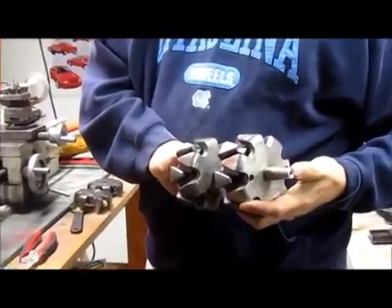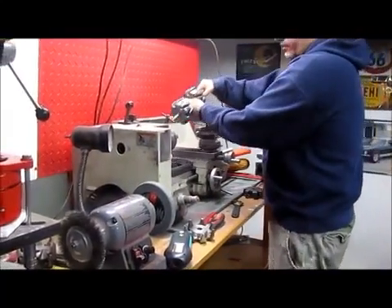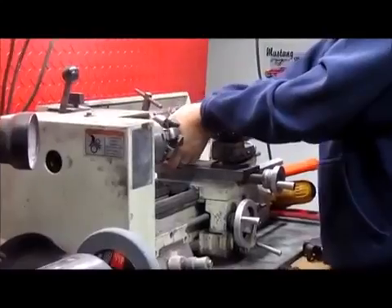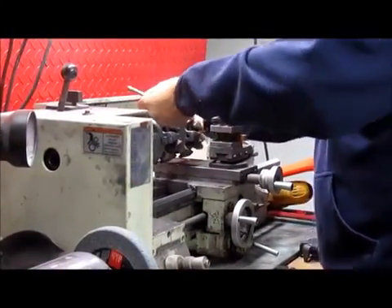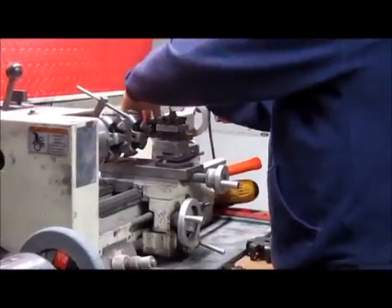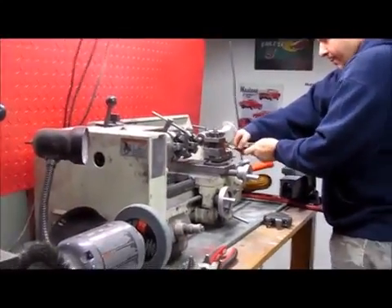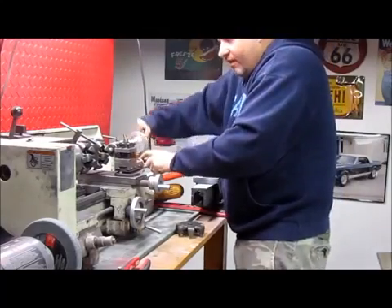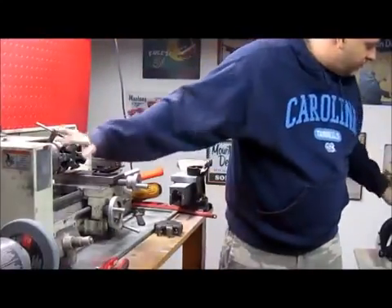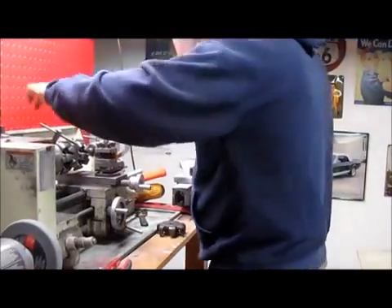You've got a case hardened race that goes on here. A lot of times you see this lathe in the background, and what we do with this is we have to set an air gap on a new rotor. I'll just show you a couple quick passes — not going to go all the way with that. This is not the most pleasant part of this job. Actually it sucks, getting bathed in these metal shards on this interruption cut with this lathe. So I put this little face shield on.